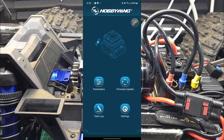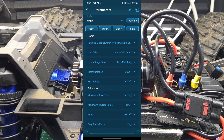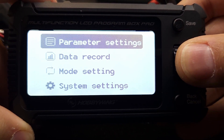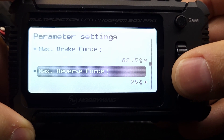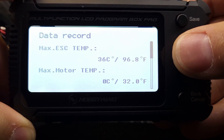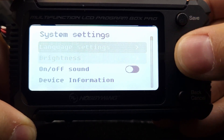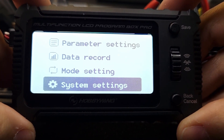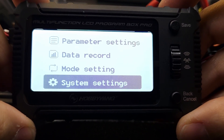Let the ESC restart, reconnect to verify that the firmware is updated — and there we go, it is up to date. You can also check and change the different parameters while you're in here through the Bluetooth connection, and you can also change the parameters directly from the programmer. This has all the standard options you would have through the app. You've also got the ability to read basic data recording information, load and save different profiles, and there are some system settings in here as well. Basically, this does the same thing as the previous version of the LCD programmer — it's just a little bit easier to use, has a few more features, and has that really convenient Bluetooth connection.